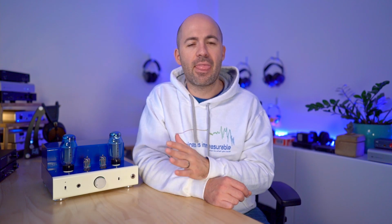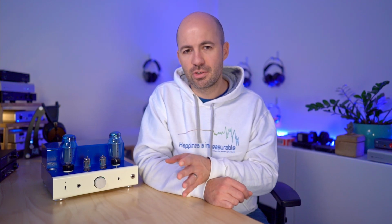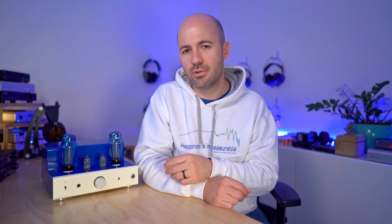My only complaint with the Sylvanias was on some tracks, and again depending on the output tubes, they could get just a little bit snappy and harsh on some of the higher frequencies. And that brings me to my final input tube, which is a very similar tube to the Sylvania, and it's the Philips equivalent tube, also Jan 5814A designation, still 12AU7, and also a NOS tube. NOS meaning new old stock. So these were produced many years ago and are still sitting around in boxes somewhere unused.